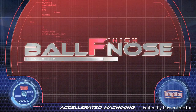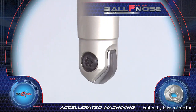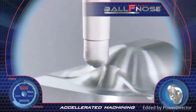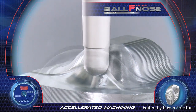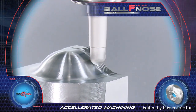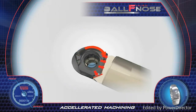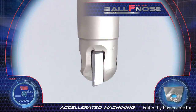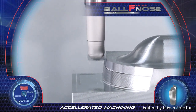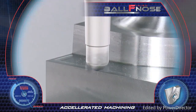Ball Finish Nose. Ball Finish Nose is Tungaloy's solution for finish profiling accurate part shapes with radius inserts. The very accurate and sharp cutting edge on the insert performs high precision 3D milling profiling with excellent surface finish, predominantly for die and mold applications. The insert's asymmetric shape assures firm insert seating with full face contact. Square inserts with a corner radius are suitable for finishing and semi-finishing in shoulder milling, contour sinking, and finish boring.